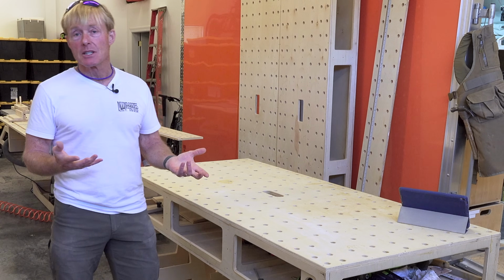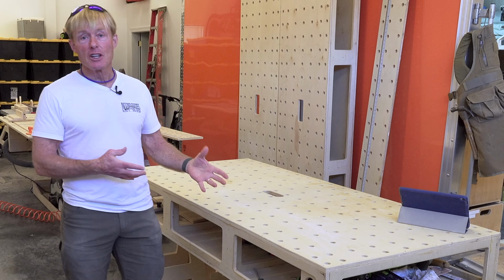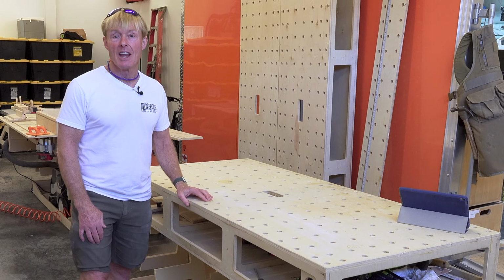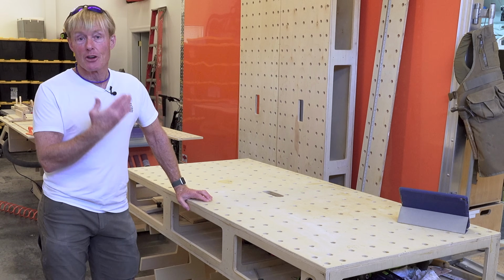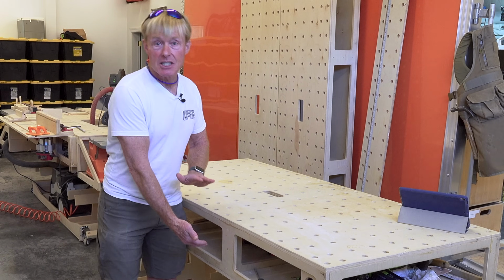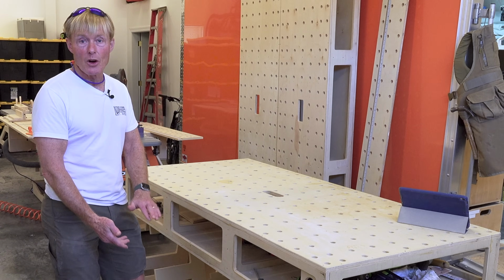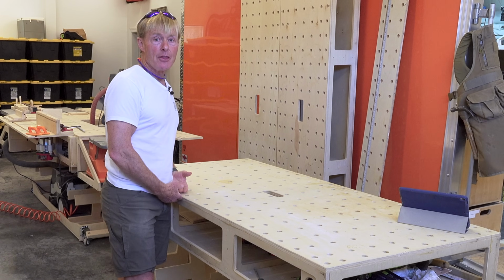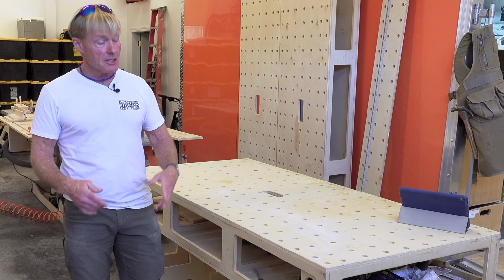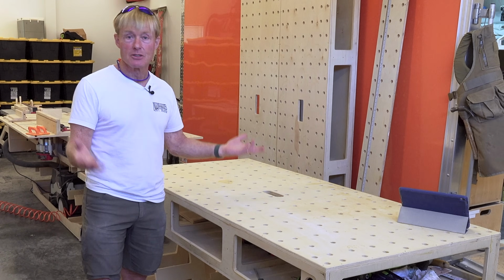So I made some out of wood, not nearly as evolved as the ones I have now, but they were still a nice feature that got the bench at the height I needed. Obviously the thickness of the bench top meant that the sawhorses needed to be shorter, because I wanted the working height at 36. Again, industry standard. Tooling is 36 inches. I wanted to use my bench with things that are around. Kitchen counter finished heights, 36.